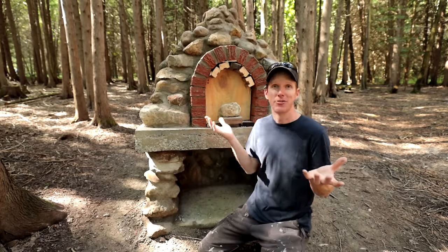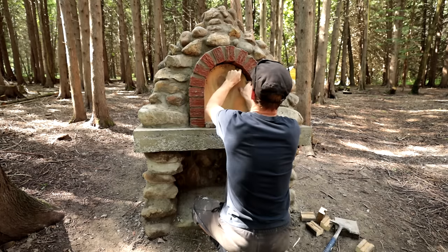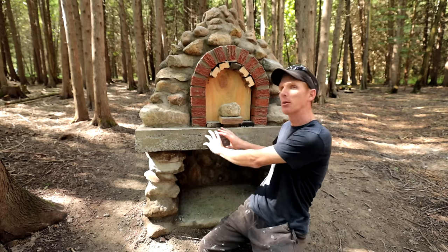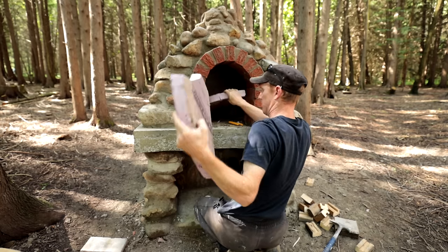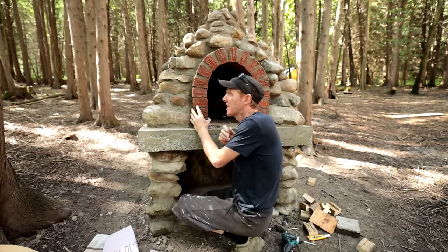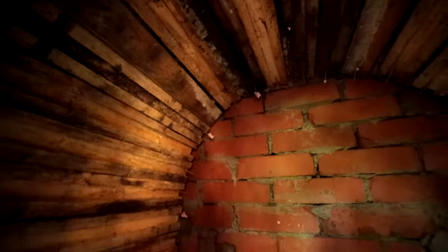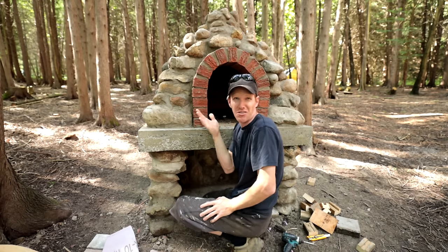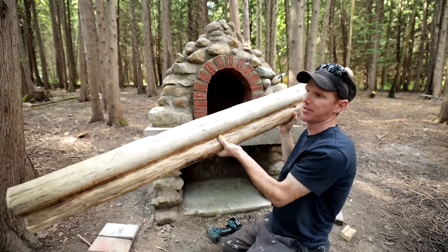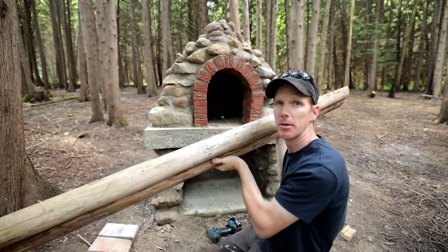So finishing up the detail work — we've loosely placed all the bricks. To get a nice smooth finish you have to leave the mortar a little while, then come back with a brush. The relative humidity is high so it hasn't been drying well, but people overlook this step — they think they're not good at it, when really you just wait until it's a little dry and then tool it out. The next day everything's dry — it looks like a little shrine. I need to put a mantle on here and take this form out. I went up to the mill and grabbed a cedar off-cut from the hobbit house build — just to cover up the rough edge of the concrete.